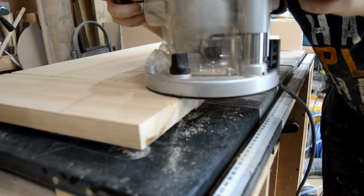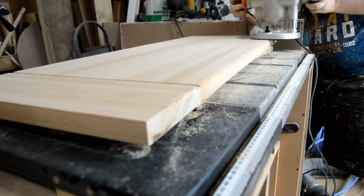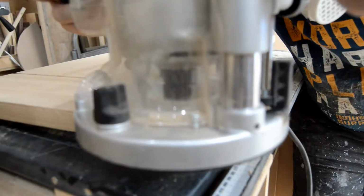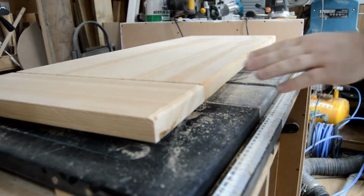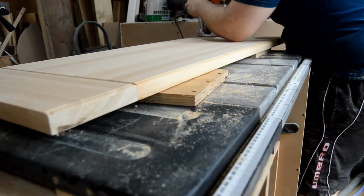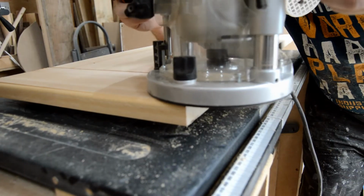I used my 1/2 inch router to create a roundover around the top. Because the top is not flat, mostly due to the sanding, the router bit does not cut equally all the way around. I therefore have to sand it down to make it flat. I did have one high side, which was easily taken care of using my hand plane.